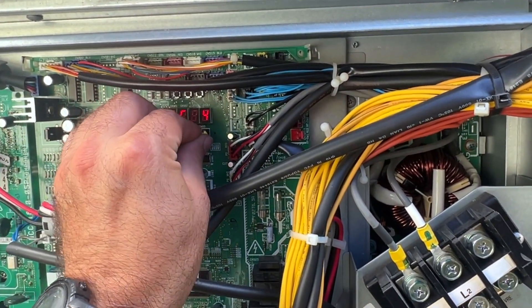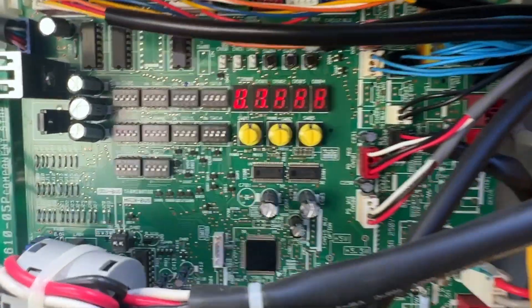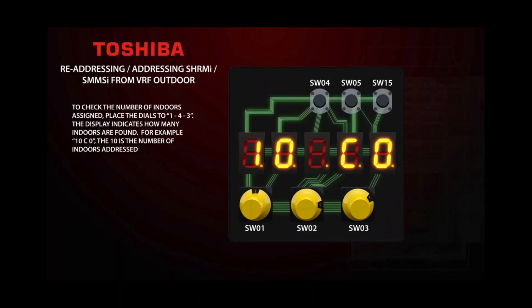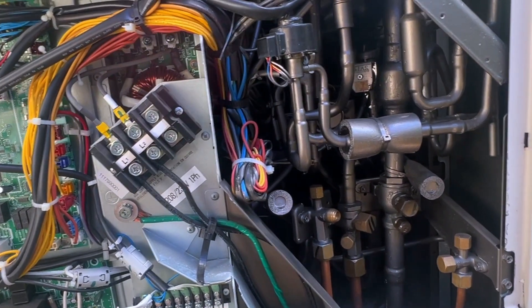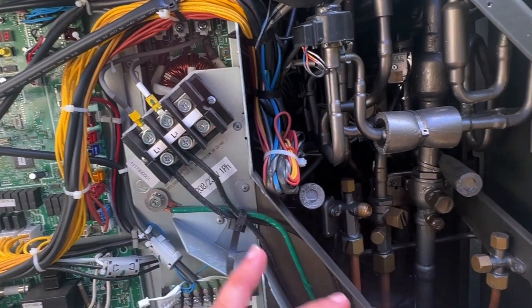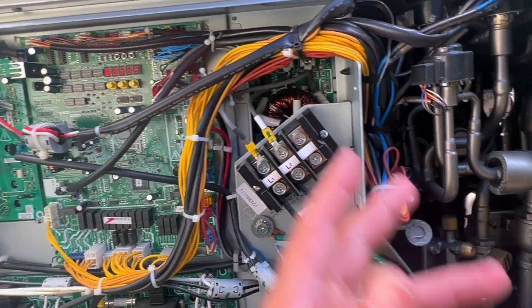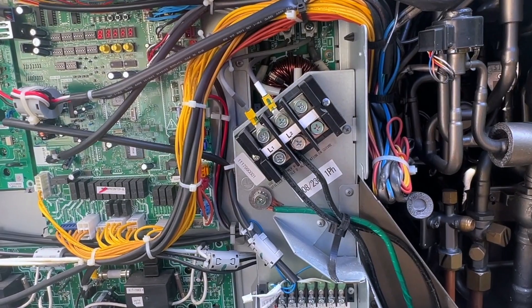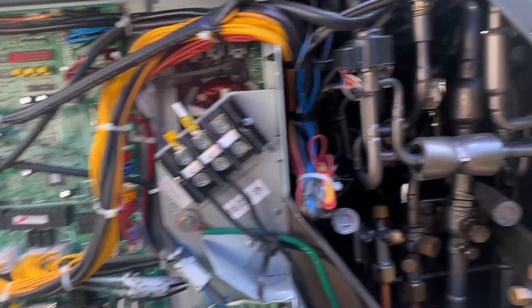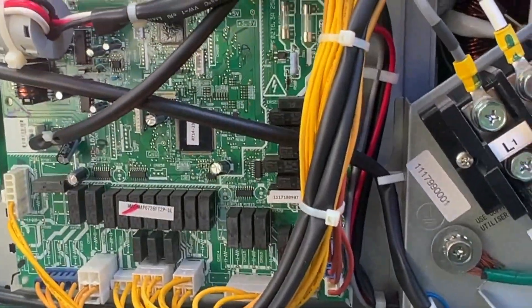Now we just put everything back to 1-1-1 and we are back to U1-DASH-DASH. All the thermostats were already set. The system was cooling when I erased the addresses, and I readdressed it, so it cut everything back off. We addressed it to the new addresses with the stat that was not found because of the replacement of the unit. Now everything is running — should be good now. Thanks for watching, like, subscribe, and share, and I'll see you guys on the next one. Toshiba!